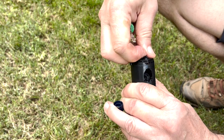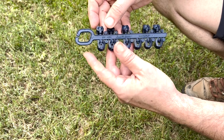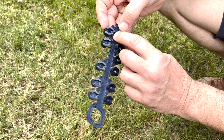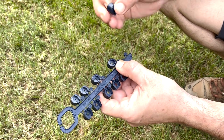We're going to put a new one in there. We have our nozzle tree here which has a variety of options for us to choose from — they are the gallon per minute sizes and you see them here on the tab. What we had in there is a two gallon per minute, so let's put a three gallon per minute on there.